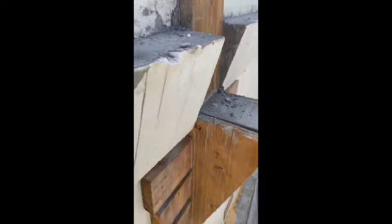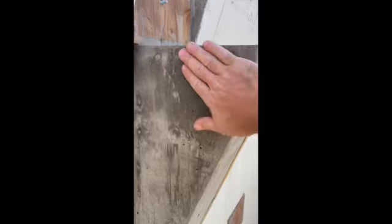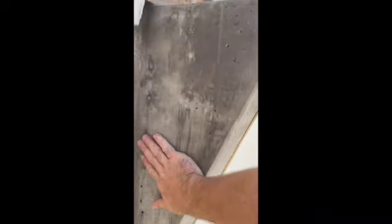Okay, here we go. We got somewhere. Dang, that is so fine. I don't think it's level, but again, that's okay. I left about a 1/2 inch from the top of here down. I need a total of, for this one, 10 inches, and I believe from down there to there, I formed it at 10.5, knowing I was going to shim it up, and so I'm okay with that. That looks nice. Vibrated it really good, and we came around and hit and tapped these. There's a little bit of air pocket right here, but I'm okay with this. There's no aggregate visible. I'm not worried about that. Dang, that looks cool.